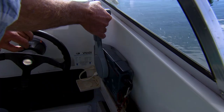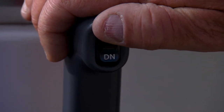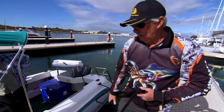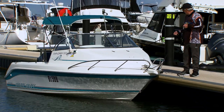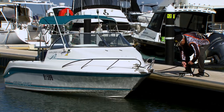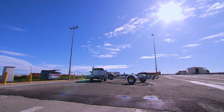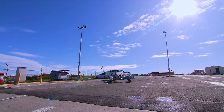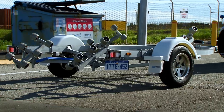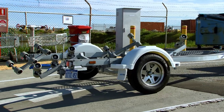It's now safe to turn your motor off. Raise the motor leg to avoid contact with ramp surfaces. Please ask your crew and guests to disembark and move to shore off the jetty quickly but safely to avoid congestion. Once the boat is secure, it's time to retrieve your vehicle and trailer from your parking spot. Release the winch strap to allow connection to the boat at the end of the trailer when in position on the ramp. Ensure that the winch is operational and that the power supply is connected if electric.